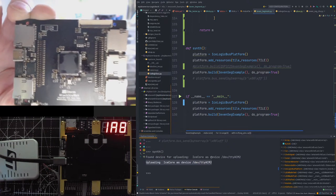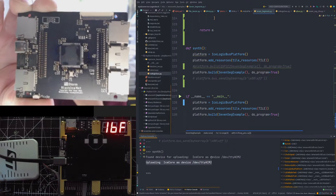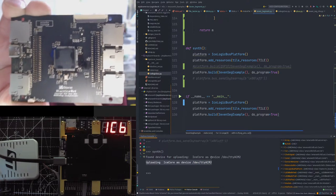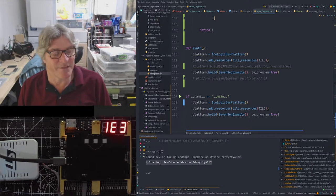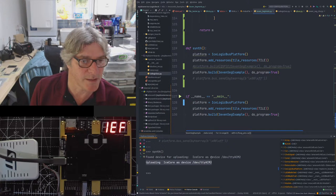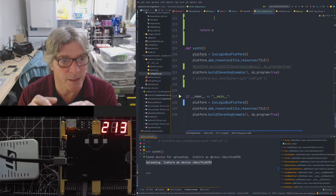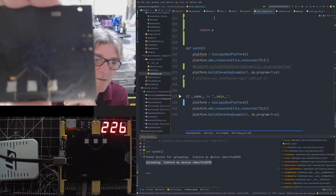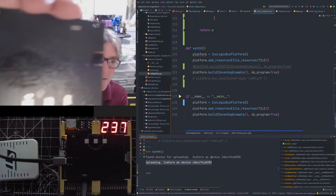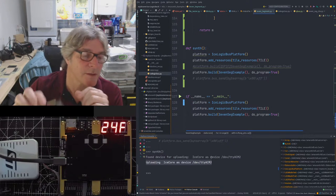This is what BlackIce NXT looks like underneath when it's populated, by the way. Although, to be fair, you don't normally see all that horrible flux. It's because I am desperately trying to repair this, but I've failed so far. I think I've damaged a couple of the TQFN pins for the STM32. So even when I replaced the STM32, it was not playing ball. I couldn't actually see the STM32 in the debug tool on the ST link. So yeah, I think I've messed with it. And look at the ugliness of stuff on the back as well. That's because it's been on my hot plate, which has obviously picked up a lot of the gunk. I'm ordering some new flux, actually. The flux I've got is really good.